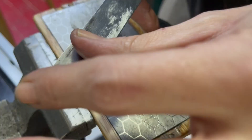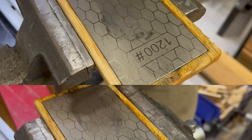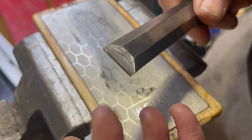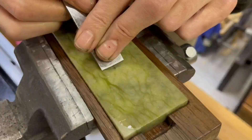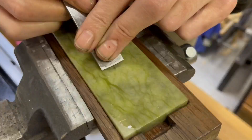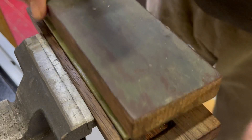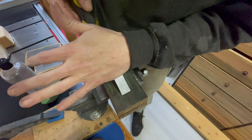You can sort of see a little secondary bevel forming there. It's getting there, getting there - I'll spend just a wee bit more time since this was completely blunt. You can see the little burr there now. It's sharp enough, so I'm going to put the fine stone on this to further refine it, then we'll use the strop. I've got a green polish here which is a super fine abrasive - just charge it up, find our angle, and come down just a wee bit.